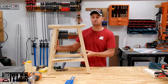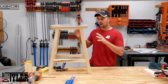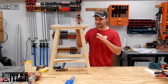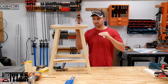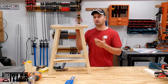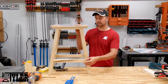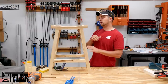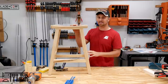Well there you are guys. Couldn't be more pleased with how these turned out, and the wife absolutely loves them, which is always a plus. I've had this one in the house for a little while and the kids are fighting over who gets to sit on it, so I've got to get the other ones done pretty quickly here. The checker, or the homemade Domino, worked out excellent for me. That auxiliary fence that I made to help hold things more stationary helped out a ton, and I also put some sandpaper on the faces of the fence to help hold everything more stationary as I was making the cuts. I've never had such accurate results with that machine. This maple's got some beautiful grain in it and I am certainly happy to showcase this in my home.